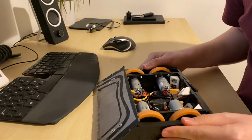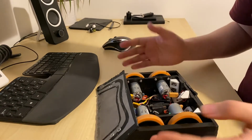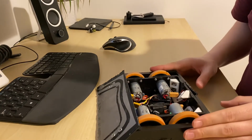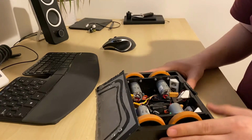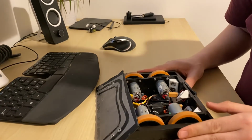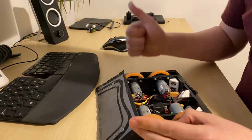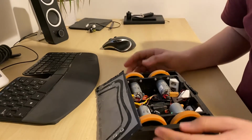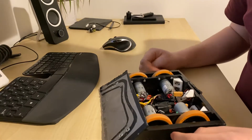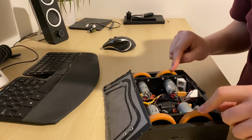Things I've tried to reproduce this at home. If I drive this at full throttle in the kitchen, it's fine. It never cuts out. The arena or the warehouse was quite cold, so I've cooled Kylo Wen down. I've left it not quite outside, but basically outside to cool down, and I can't reproduce the issue. I've held my foot on it and basically held the motors at stall and tried to drive it, and it doesn't cut out. Everything keeps working. I haven't got a large sheet of steel to try driving it on, so I can't test anything about that.